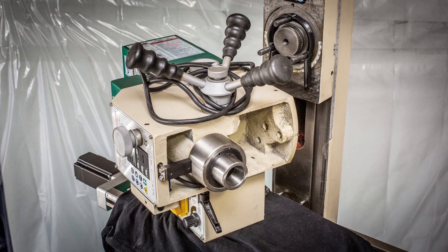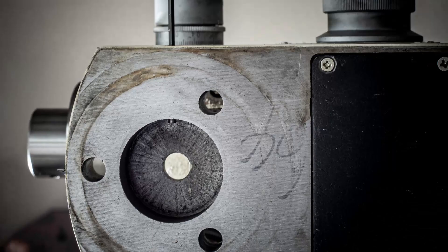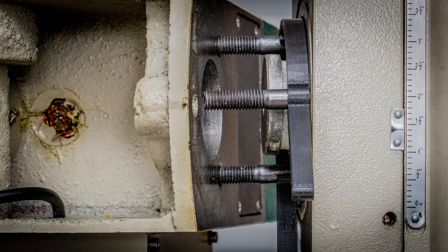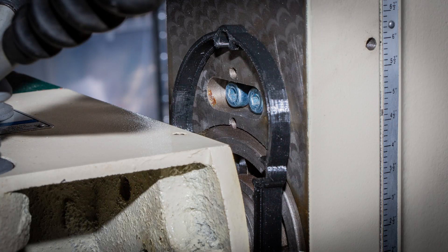With the headstock resting on its side on the mill table, I check the set screw on the side of the headstock, being sure that it is not protruding into the hole as shown here. Next I lower the z-axis slide and align the bolts to the holes in the headstock — the 3D-printed jig makes this task simple. With all three bolts slipped into the holes, I unclip the jig and remove it.